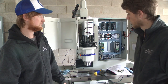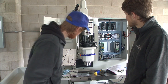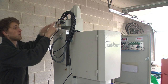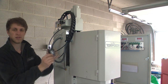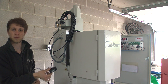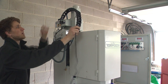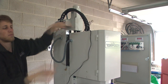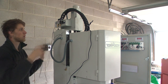We'll have to ask Tormach or something, or maybe it'll just work. Up here, this panel is new — that's part of the drawbar. This is your air solenoid, and it comes with a little switch. I'm pretty sure this is your on-off switch for the power drawbar. We also got the foot pedal set up, so that'll be much handier. It's got this thing with two air hoses that basically go in here to the cylinder. It's got a wiring plug that gives it power to do all this stuff.